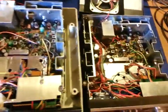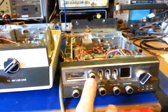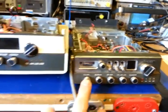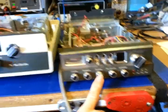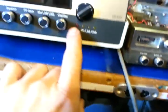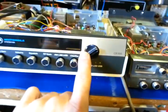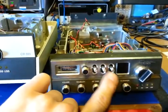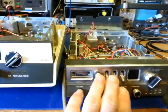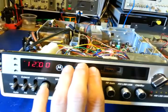The only real difference is this one doesn't have the mic gain control, but it still has the SWR calibrate. Volume, squelch, RF gain, mode selector, clarifier — transmit AM, lower, upper sideband — channel selector, and the switches here were removed from this location along with the SWR calibrate control on the base station, because they were moved down here.